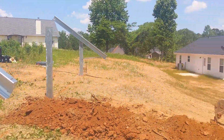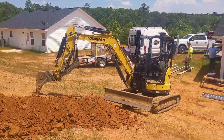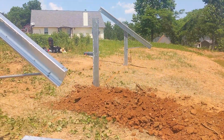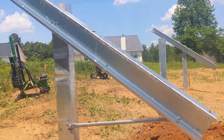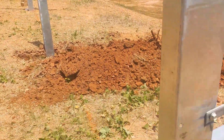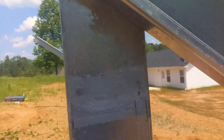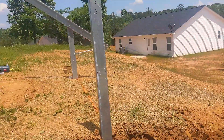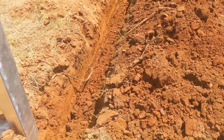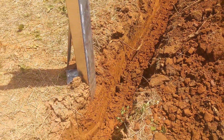And I'm just bringing a trench over to where Johnny's working. We're setting it 35 degrees. Very easy, nice hardware, same size sockets. And we're going to bring up a wiring trough here. This is another grid-tie SMA string inverter job.